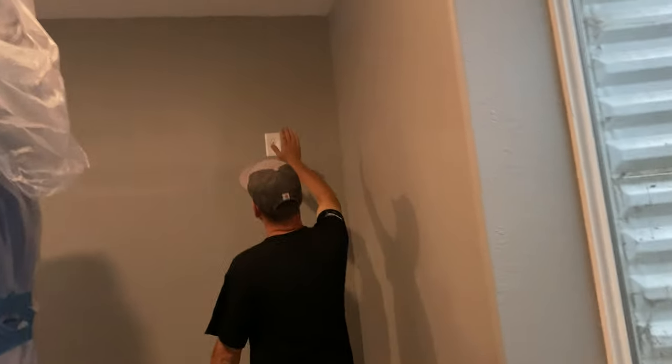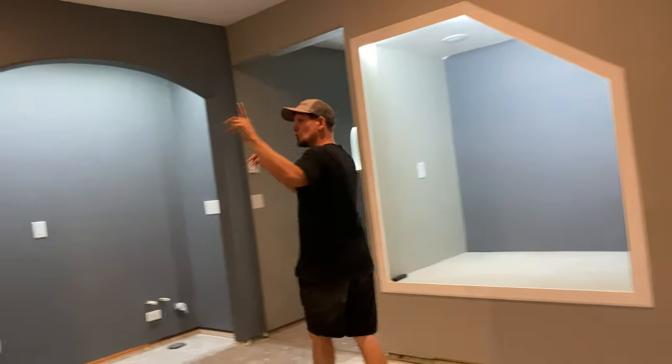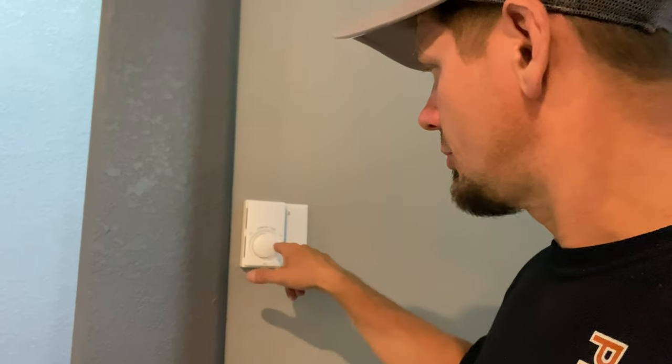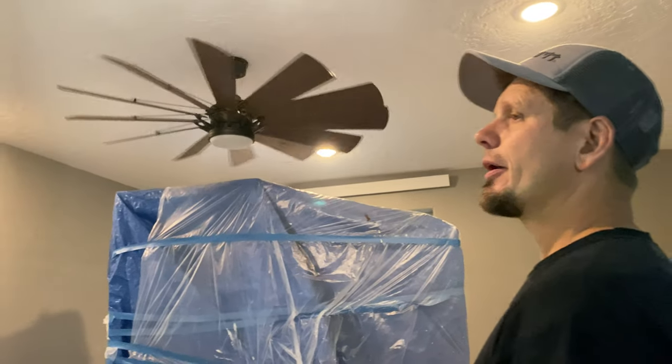Right here is a TV-mounted outlet — don't forget those. Thermostat in here, of course, controls your two valances. With the cove heater up there, the thermostat is not going to be on the cove itself, and most of them are not going to be Wi-Fi'd with a remote. But here's going to be your thermostat right here. Keep in mind you do not want it underneath the heater — you want it away from the heater so the room fills up with heat first.